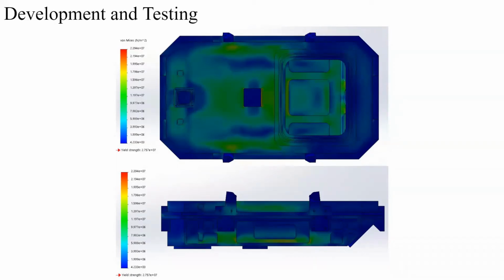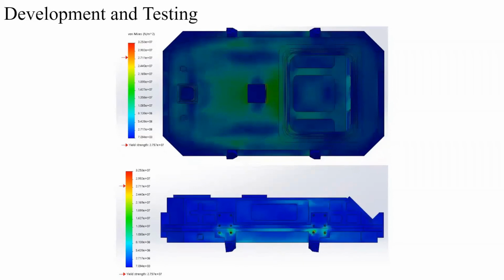We suppressed many components of the full assembly to focus on the hull itself, since many pre-manufactured pieces that we buy from suppliers are rated for those pressures. These first two images show the top and side views of the hull assembly with an outside pressure directed inwards. We used 1060 aluminum alloy for the hull. The factor of safety for the higher stress green regions gives us a value of about 1.5. These next images provide the same views, but for an inside pressure directed outwards. The factor of safety found is lower at about 1.2.